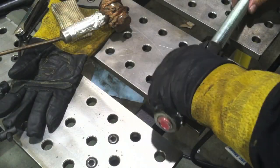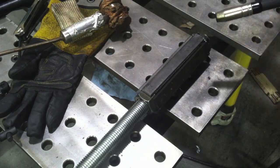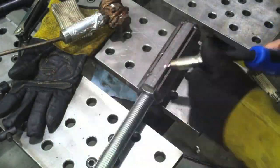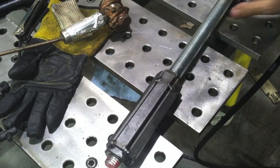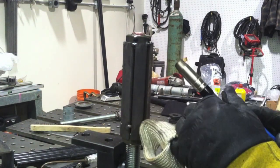I'm using some stuff that was laying around. Ideally I wouldn't have any gaps — one-inch flat might have worked if I shaved a corner off, but I didn't have any. So I'm leaving one nut as a free-floater, just putting a tack inboard from the nut. Because if I weld that nut in and weld all the welds together, it's going to bind up tight. I'm hoping to keep things nice and loose by leaving that one nut not welded.